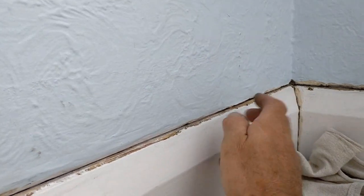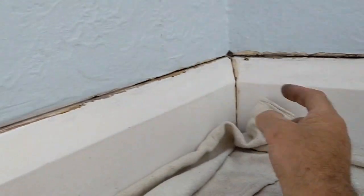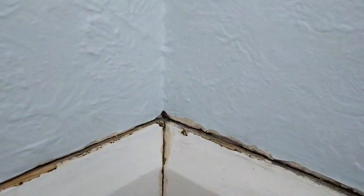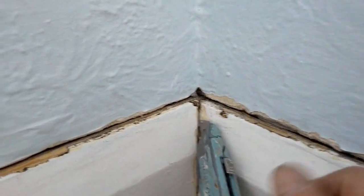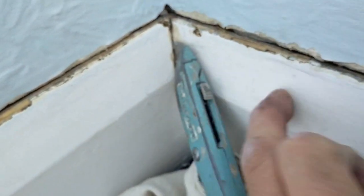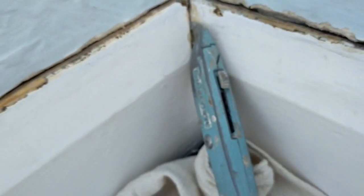There's a bit of a gap down there, and when all this degrades at the background and crumbles away, we're left with all this. If you come along and put your caulk over the top of that, it's not going to do anything because there's a little bit of movement and vibration going on here. I'll rake that out so we can see how they've done this — that gap is down there, and this piece of skirting is floating, as in moving.